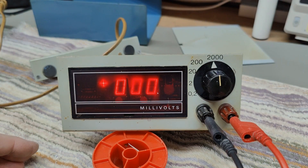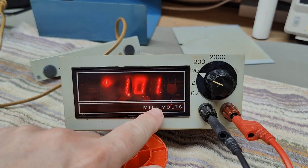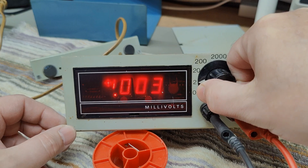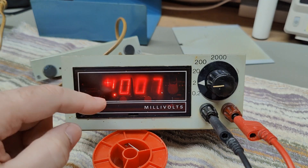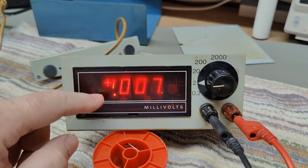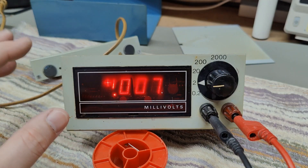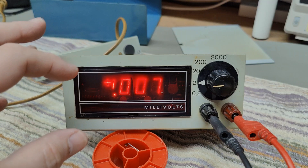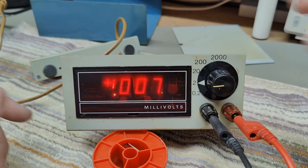Let's get in here. That is not working. So it's volts — what you see here is volts. This is misleading; this is only the instrument. So this is the 20-volt range. There's a broken digit. That will probably come back after a little bit of time. I think I can see it's growing and growing — this is normal for old Beckman displays. You just need to give them a little bit of time and the cathode will rebuild or re-clean itself somehow. I'll just leave this on until tomorrow.